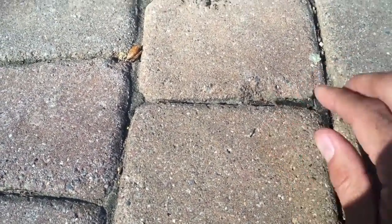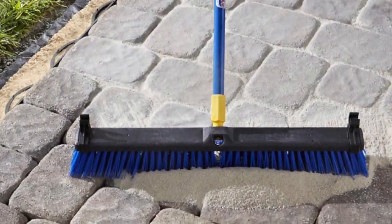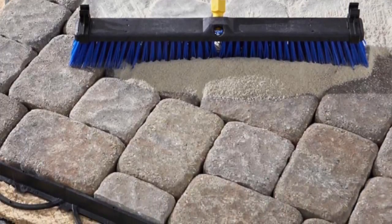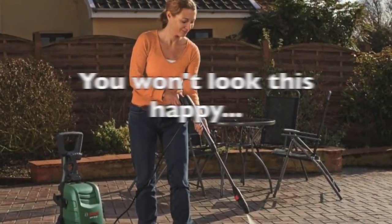Now, paver patios have a certain element of maintenance regardless, but you can freshen up standard sand compounds by grabbing a bag of sand and sweeping it in and hosing it off every year. It takes you 30-40 minutes at the tops. If your polymeric sand breaks up, you've got to remove all of the polymeric sand and start all over again. It's a higher level of maintenance down the road.